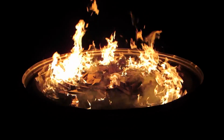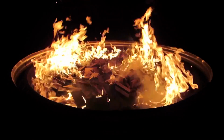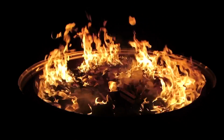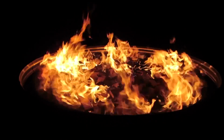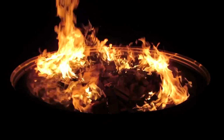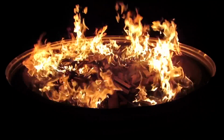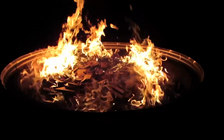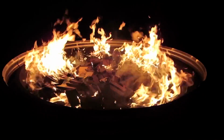A couple of things stand out as we get the kiln almost to the top. The flames can appear a little lazier sometimes on the edges. A little bit of that sense on the right hand edge, and also the vortexes are now quite a bit smaller when you can see them in the smoke. They're rolling, but maybe like a 20 centimeter vortex instead of a 60 centimeter vortex, probably because it's constrained by the fact that there's only about 15 centimeters of open space left vertically in the kiln now.